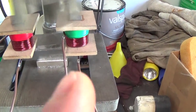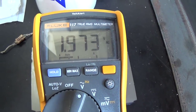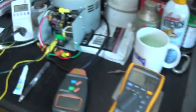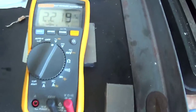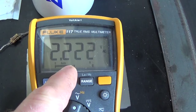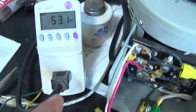So basically this is a regular generator effect right now. We're delivering not quite 5 watts there, just under 2 volts, and the power is being reflected back to the prime mover. And now when I short this side of the coil, the power goes out — the output here is higher. We're pretty well at 5 watts now; 2.22 volts is just a tad under 5 watts.